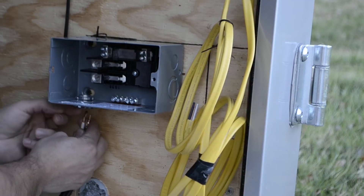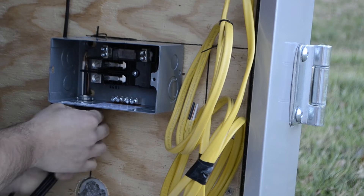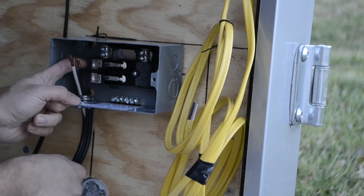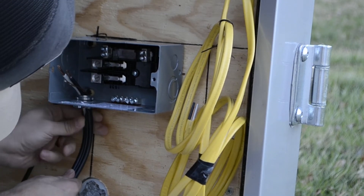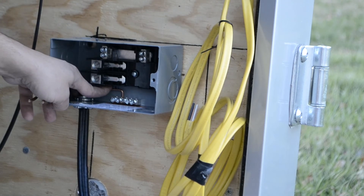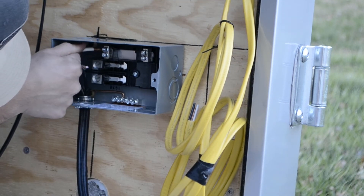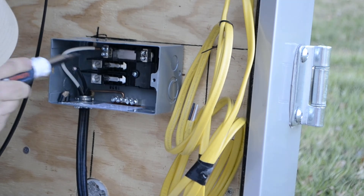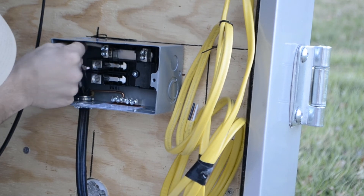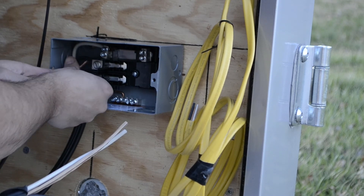To energize this subpanel, on the outside of the trailer there is a four-pin locking 30-amp connector. I figured at Home Depot that a 30-amp locking connection must be what RVs use. However, once we started to look at actually plugging in the trailer, we quickly realized that a four-pin locking connector is almost impossible to find an adapter for to run regular RV extension cords or adapters. So what we ended up doing was going to an RV supplier and picking up an appropriate three-pin 30-amp inlet.